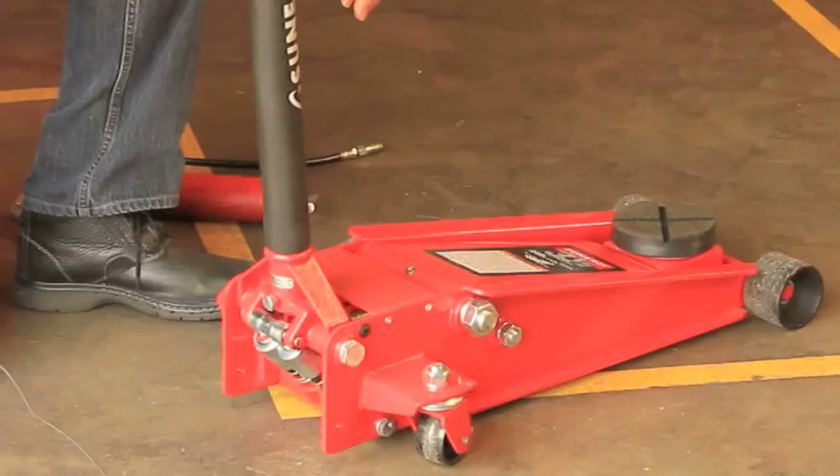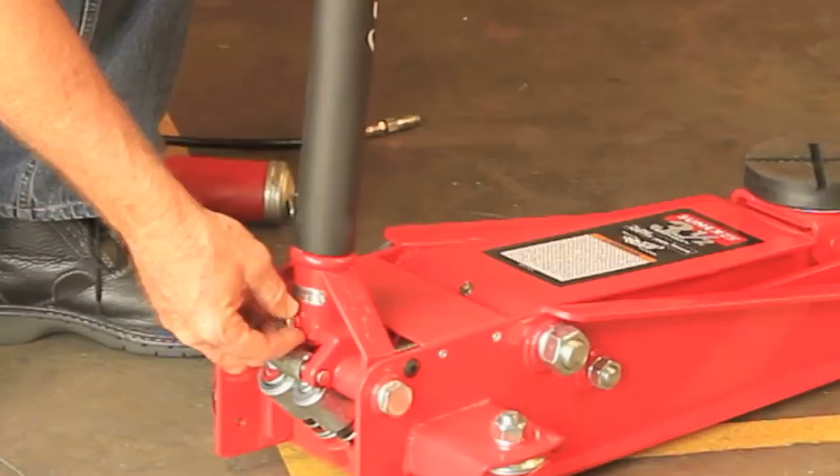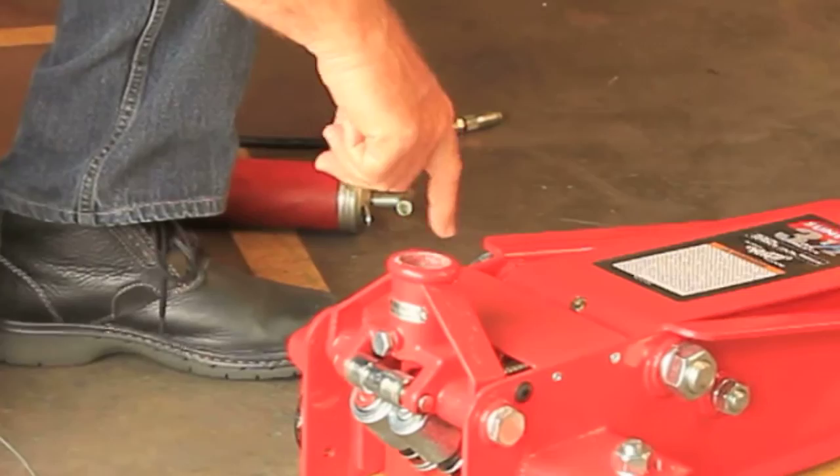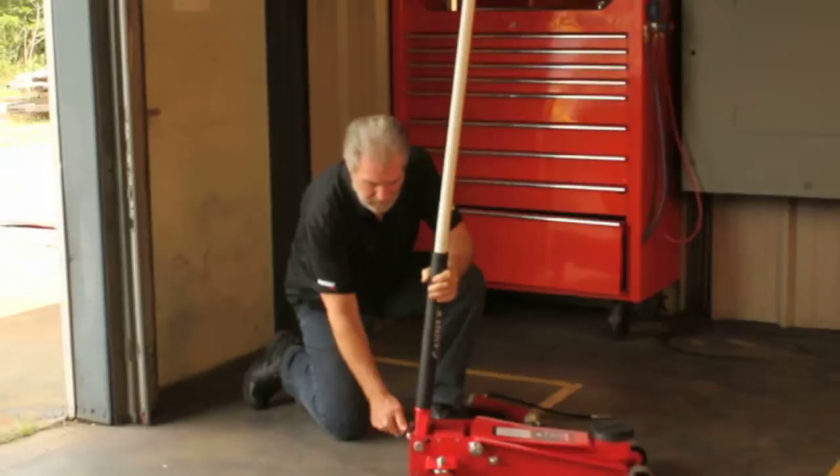In the area of the release valve, down in here, there is a universal joint — put grease around that. The last place of lubrication would be the handle base, where you would remove the handle, take some grease and put it on the inside surface of the handle receiver, put the handle back in, and lock it by turning the screw. This would be the complete maintenance procedure.